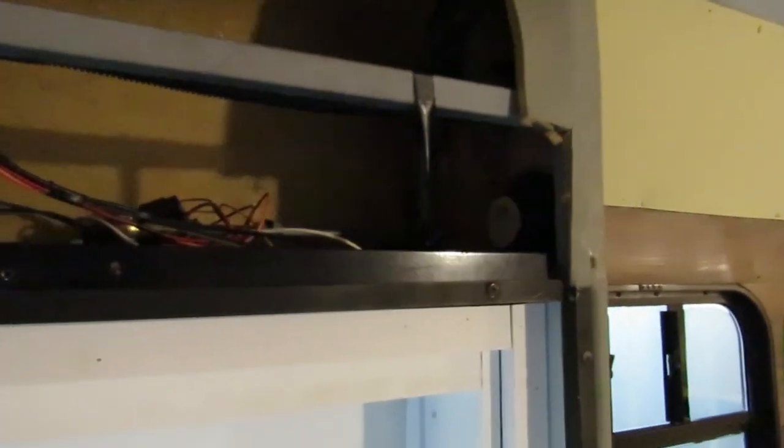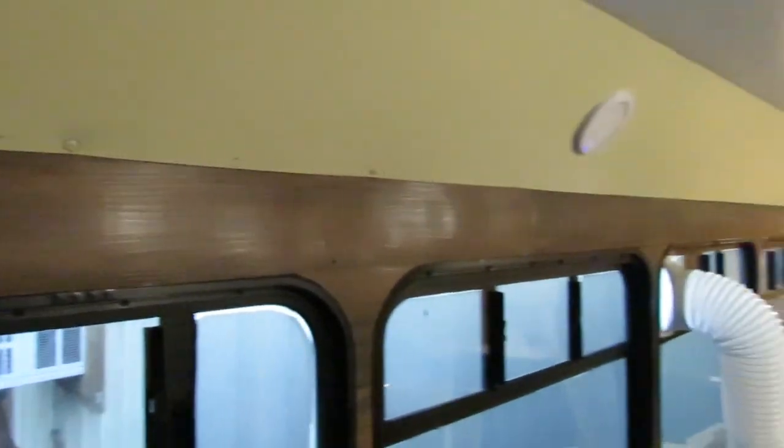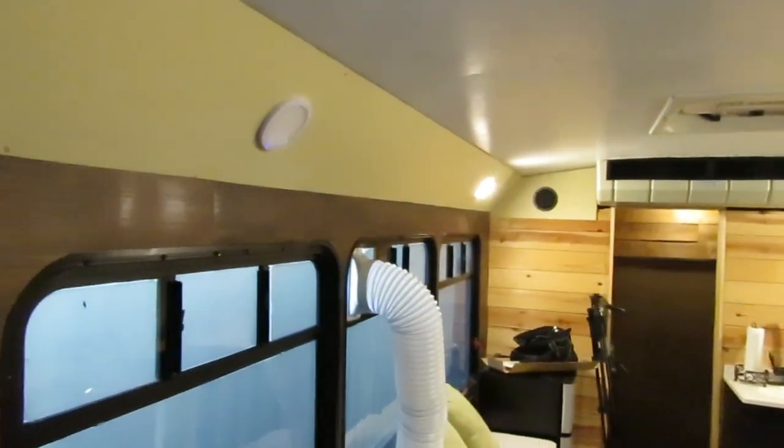Okay guys, this is above our door. I just took the little panel off and just like the other side I need to have something to hook to, so I went in and added a little 1x1 piece of angle. I was able to drill through the front side and put an eye bolt through and bolt it, and that'll allow me to connect the cable on this end. The other end goes easiest into the wooden frame.